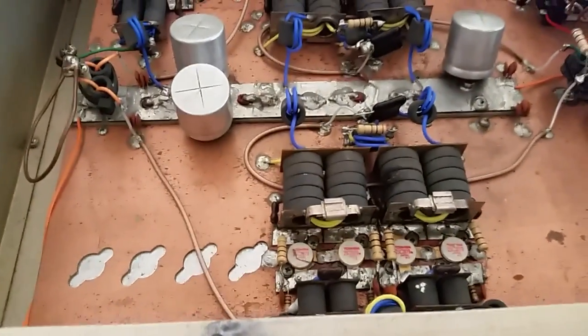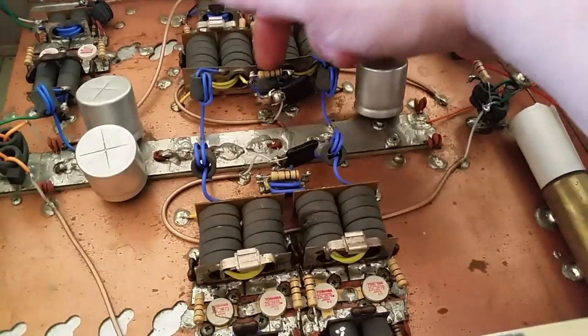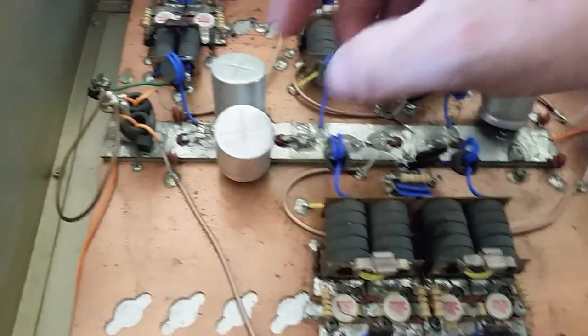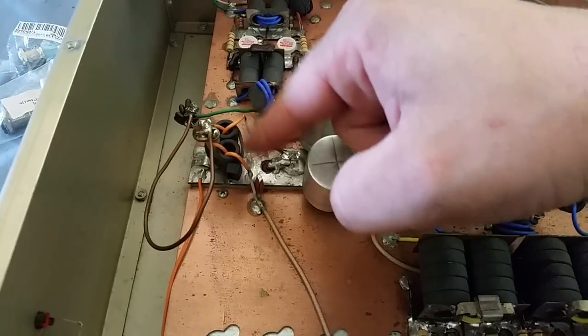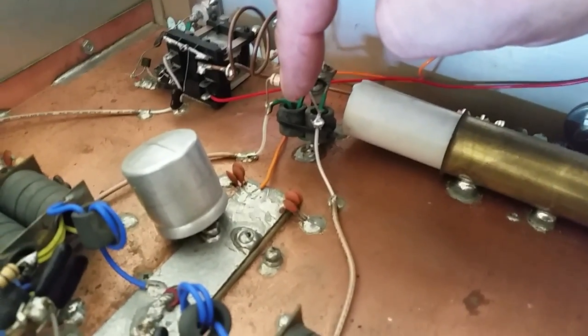And there's a couple other things. We're going to be pulling all these Toshibas out of here. There's probably some blown ones. I don't know. I can tell where people have taken these off and put on new ones. They possibly could have popped some pills, put on some new ones right here. You can tell they didn't add the input one back on here, which, you know, this one's not really mandatory, but still good to put one if you can. And I can tell that this one right here has been added. As you can see, look how long the leads are on that thing.